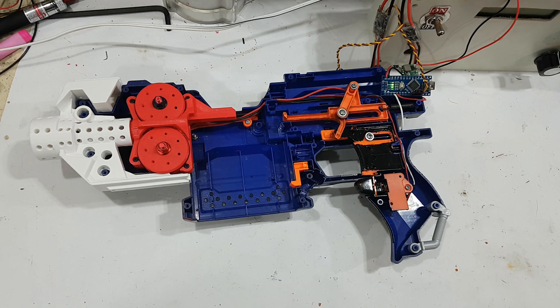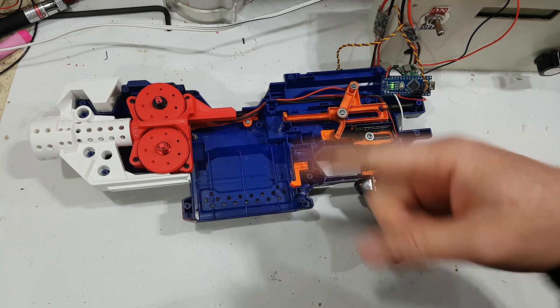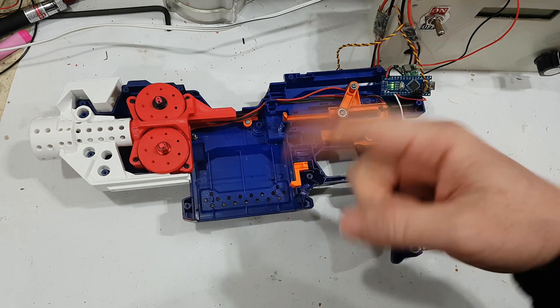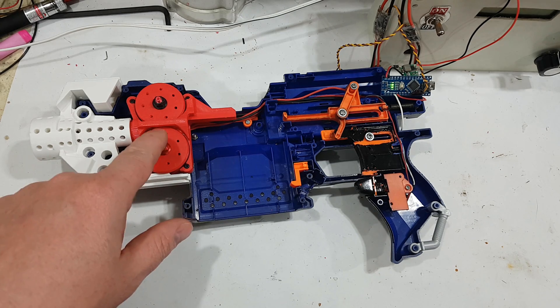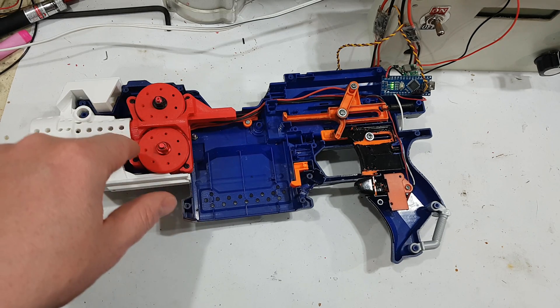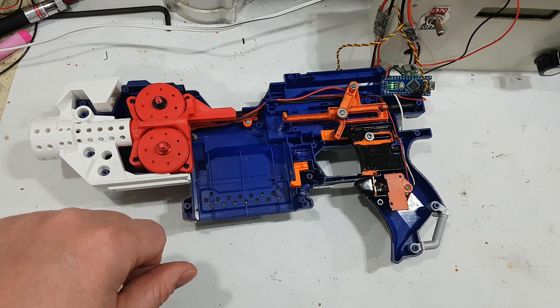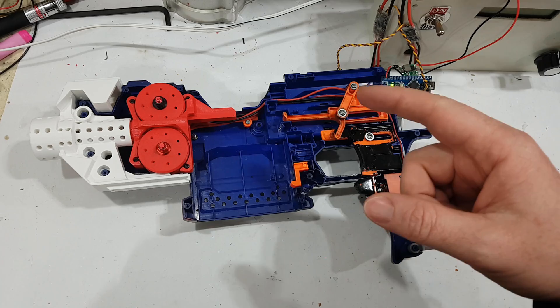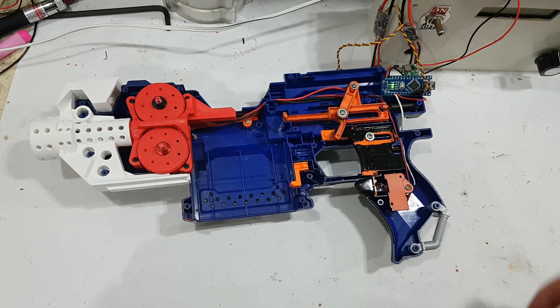Welcome back everyone. In a previous episode on doing the wiring, I talked about the ESC and motor braking — how I really like the idea of fast spin-up and fast spin-down, but the problems with that are that it caused excessive heating of the motor, excessive wear on the cage in the motor due to the torque going backwards, and it resulted in regenerative braking back into the power supply, destroying all my electrics and potentially the Arduino.